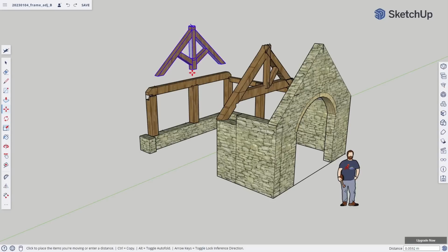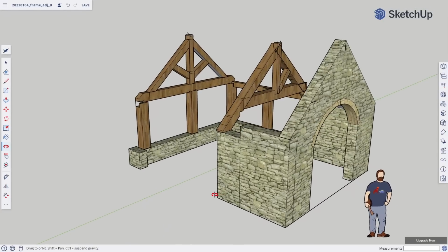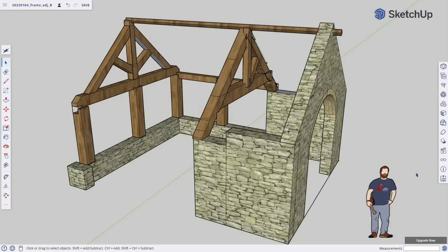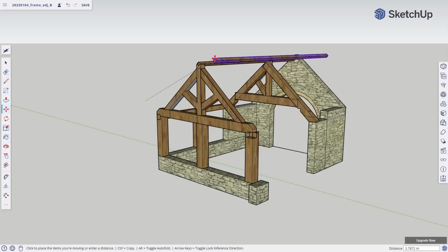Now, you might be wondering, if I'm working on this top back bit, why am I messing around with purlins? Well, in a minute, when we come to drop this down, it's going to find itself sitting here unsupported. And I've got to say, that makes me very, very nervous indeed. What I want to do is get the purlins in as quickly as possible, starting with the one at the top that offers the most structure. The problem is though, if I've already put the top one in, how am I going to get the back one over the top? And remember that I'm approaching from the right of your screen with a telehandler.